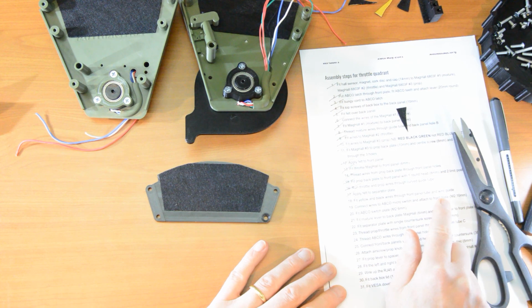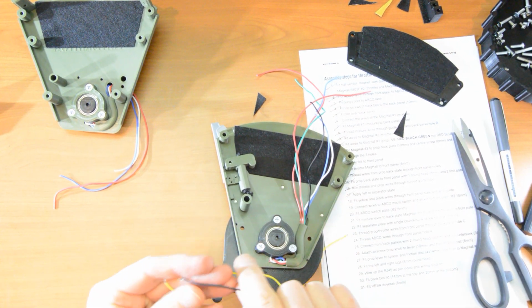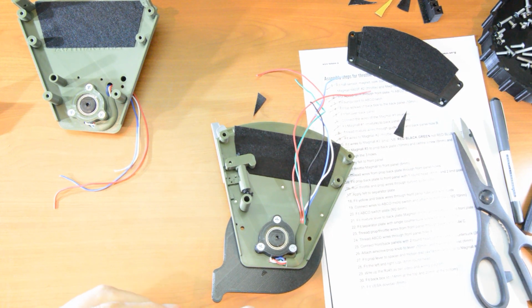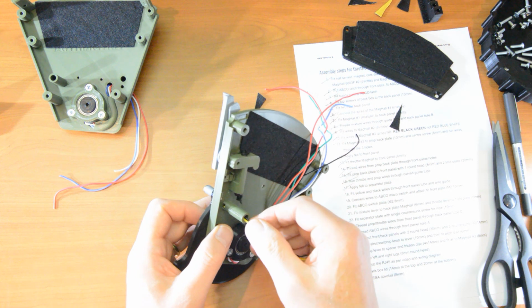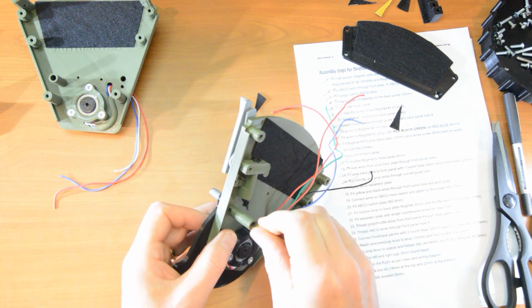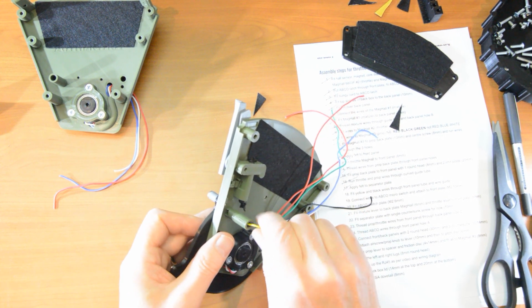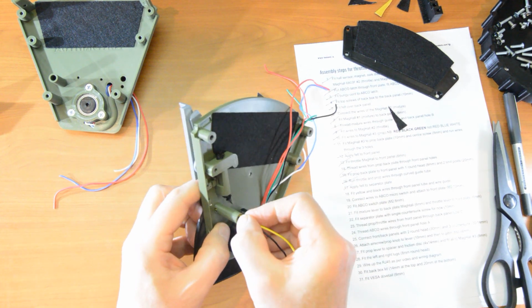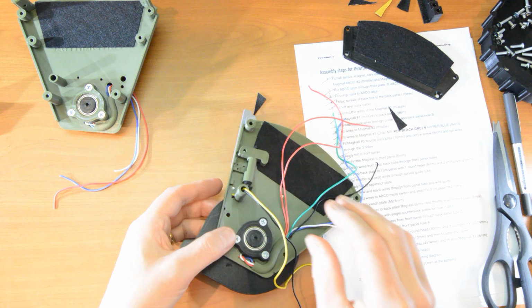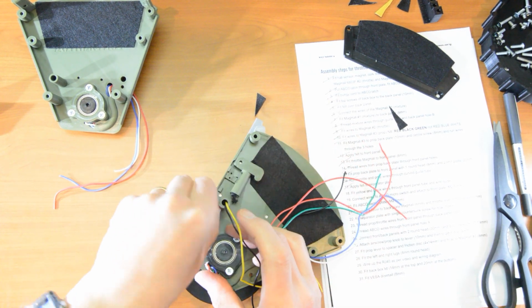Fit the yellow and the black wires through the panel tube and wire guide. This is the panel tube and wire guide, and these are the yellow and black wires. So let's thread them through. Now I've already taken the ends off these. They'll be easy without the ends. So thread them through from the top, and then they should just poke out the bottom. If they don't, just twist them and wiggle them until they do. And if they're still misbehaving, give them a little twist, put a little L bend in the bottom, and then try it. That should help them pop out like that. And if you can just get a little bit exposed but they're not really coming out, then use a screwdriver and just help them out. Okay, so those are your yellow and black wires.